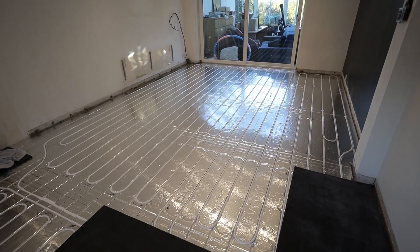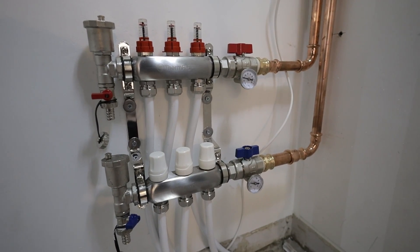We've got all the pipework installed today, the manifold is installed, and the system is fully pressurized. There's five bar pressure on the manifold right now and we're going to leave it like that so if someone touches the pipework they'll know immediately.